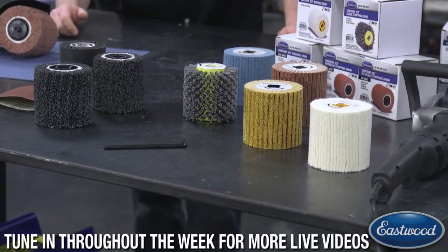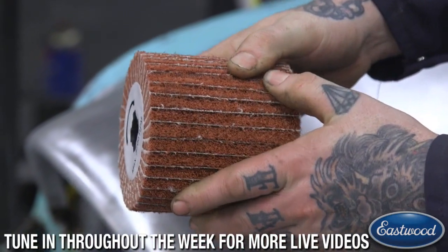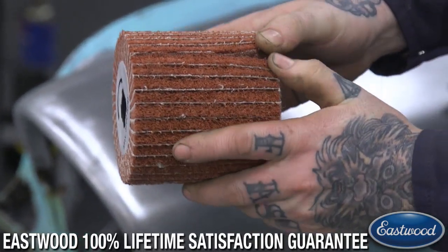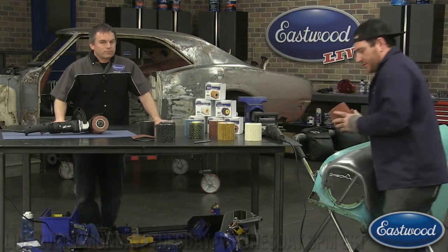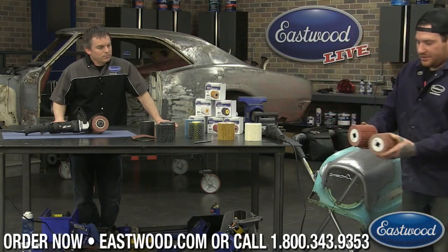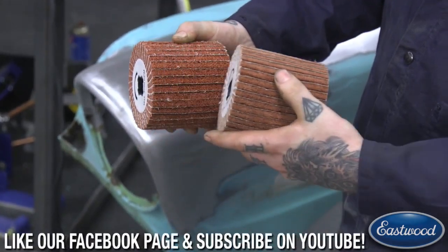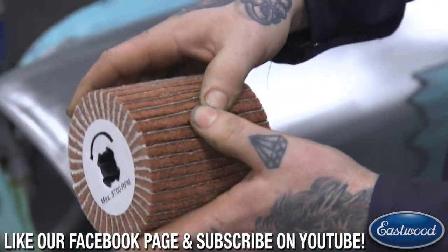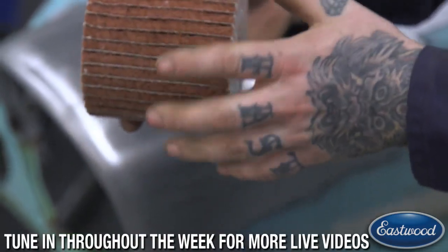A buffing wheel — this is pretty cool for you guys that have been asking about it. It's actually sandpaper in between the layers, kind of like an intermediate between the red and the black. This one is the 80 grit — so we've got a 240 and an 80. In between each layer of the woven material, it's got a piece of sandpaper, so you're going to get a lot more life out of it as it's spinning. It's going to be using the sandpaper as well as the woven material, making it a little more efficient than using just the red one.